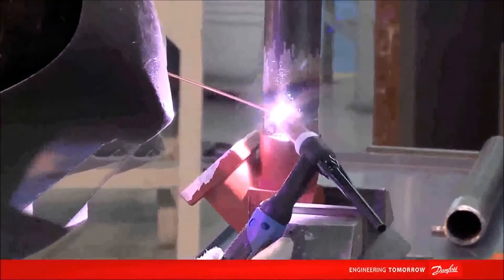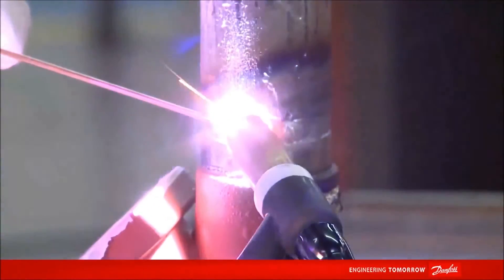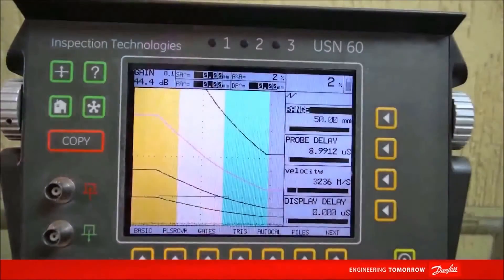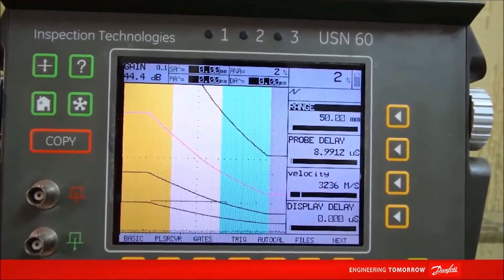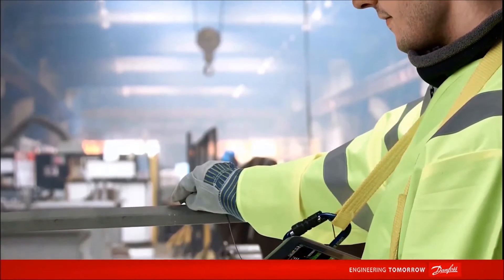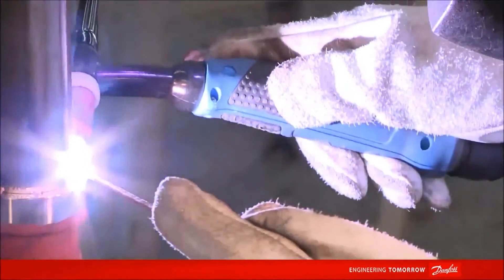There are some companies that require certification of the execution of the welding, with issued reports from x-ray or ultrasound inspections, to verify if there are cracks in the weld. With a SOC connection, you don't need to verify this, making the process faster and eliminating the expenses associated with certification.